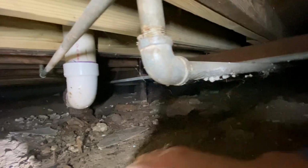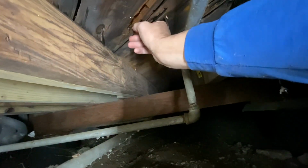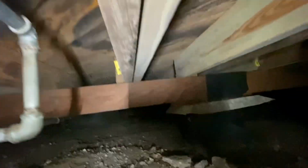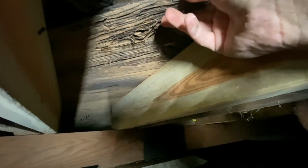Before, they weren't ready to cut out the floors and do all the invasive procedures and techniques to replace the subfloor. But you can tell now how damaged this subfloor is. This is a little tongue and groove laid a diagonal, and it just chips and breaks apart. I'm actually right underneath the tub. There's the P-trap for it, old P-trap right over there. And so that back wall of the tub's gonna be right through here, and you can tell with just that water splashing down on the tile, coming around about the tub, it's just rotted out that subfloor even more.